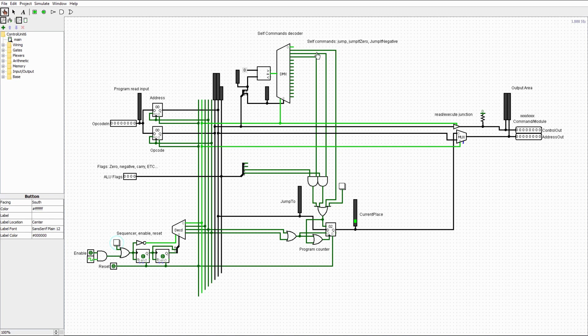The three commands after the null command are: unconditional jump, which jumps the program counter to a part in memory; jump if the accumulator flag is zero; and jump if the accumulator flag is negative. The only one you truly need for completeness is the zero flag check, but negative is very useful. Carry is the next most useful, and the fourth slot can be whatever you want.